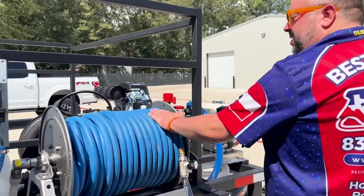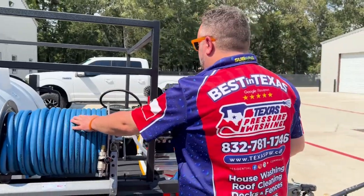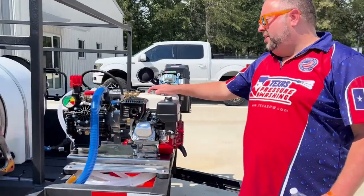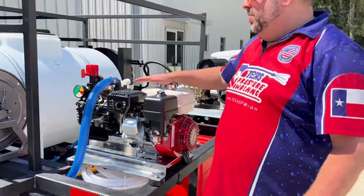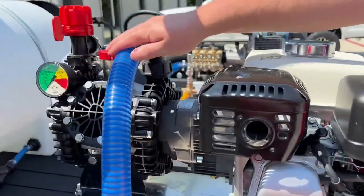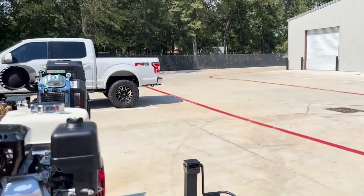This is an 18-inch reel — that's the minimum you need to fit 200 feet of 5/8-inch hose on there. This is our AR-45 on a Honda GX200, and we have it set to operate in the green on the trigger at about 180–190 PSI. Off the trigger, it's about 250 PSI.